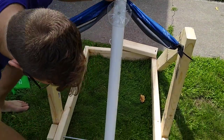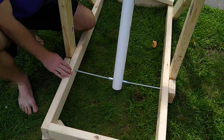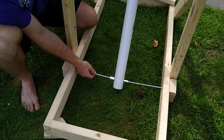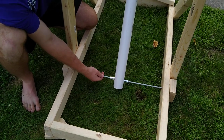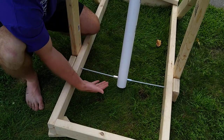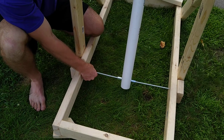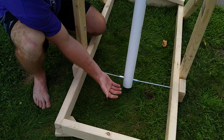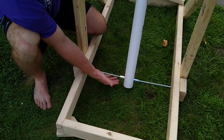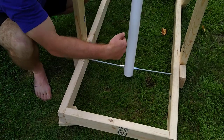At the bottom, the mechanism that works here is a 3/8-inch bolt that's 2 feet long. You might want to go a little thicker, as the tension can put some bend on it. I just screwed right through on both sides and put a little 2x4 to cap it so the bolt doesn't move side to side. You could also add a washer to really lock it in place, but that's not necessary.